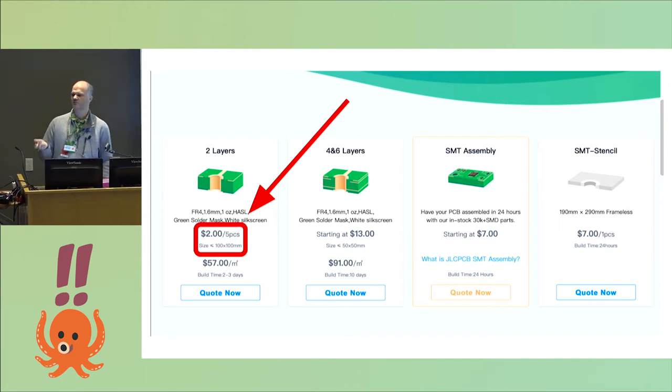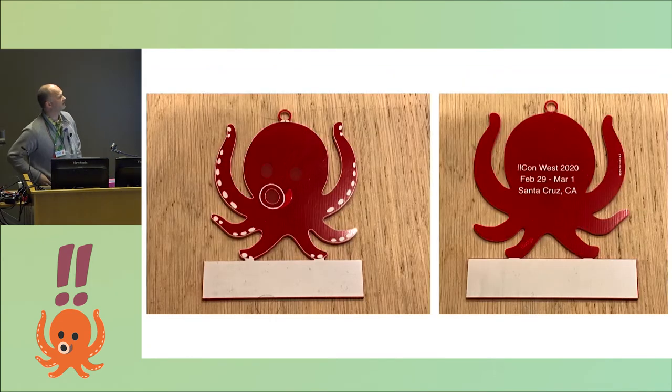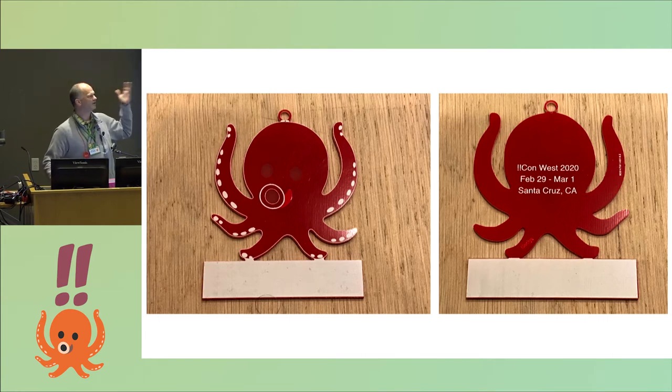That made me think: you can use PCBs for pure mechanical things, not just electronics. I don't know how to use a 3D printer or a laser cutter, but maybe you can use PCBs for mechanical purposes. As a proof of concept, I decided to design a badge for BangBangCon. I installed Inkscape, uploaded a bitmap, converted it to an SVG file, and used a plugin called SVG-to-Shenzhen to convert the badge design into a PCB. I gave that proof of concept to Josh, who really took it to the next level — that's basically the badge you have around your neck. The key takeaway: PCBs are so cheap and easy to make, and you can use them for more than just electronics.